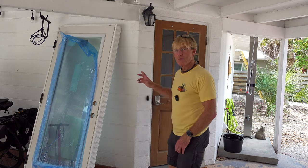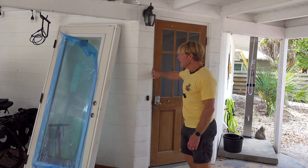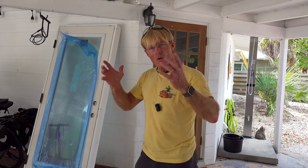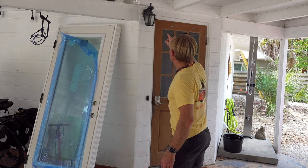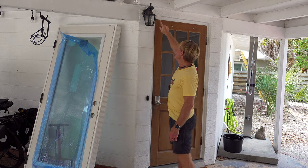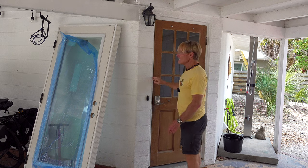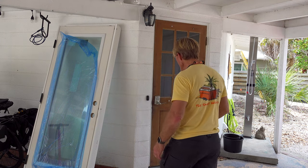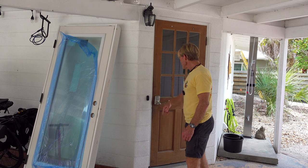What I'll do is I've put a buck in. I'm going to use a three-quarter inch buck on one side, and I'll cut the other one down, or cut them both down and have a little more room. I'll caulk the sill before I set the door in, and the top will have no buck because there's only about a quarter of an inch there, so I'll foam that — which is what I did on the front. On the sides I'll have the bucks and good attachment with the tap cons, but I want a little air space around because I want to foam or caulk around. I like to seal up with that and try to have the wood tight, but making the wood tight doesn't work anyway because that moves.